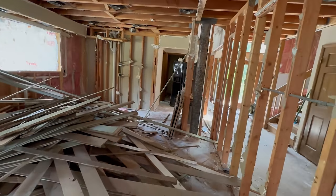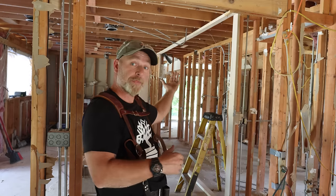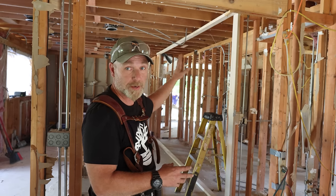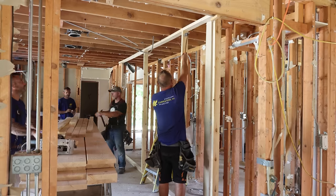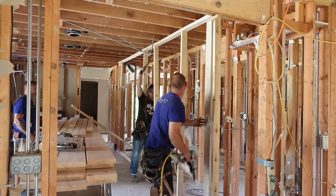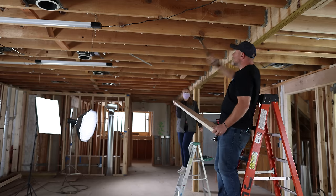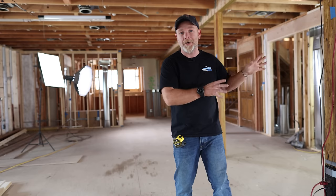After a little bit of cleanup, this is what that wall looked like between the hallway and our kitchen. In order to put the main beam that's going to run across the entire house, we need to support the floor from underneath. So what we're doing here is building a temporary wall, and then we can start cutting out all the joists. My contractors actually set up the temporary walls without me having the camera right there, so I'm going to set up a temporary wall now so you guys can see that entire process, and then we can remove our load bearing one.